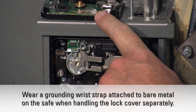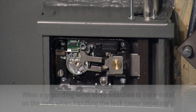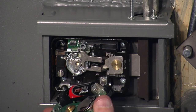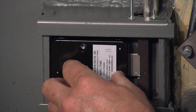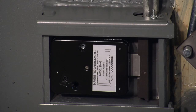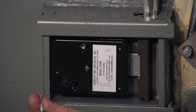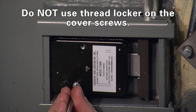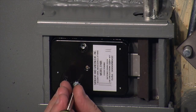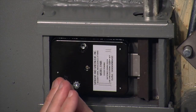Now that we have our batteries installed and we've received good battery check signals, it's time to put the cover on the installed lock body. It goes in so that our pin connector on the cover mates with the receptacle on the body. We have two different length cover screws — the label tells you the longer screw goes in this hole and the shorter screw goes in this hole. Each screw must use a lock washer. We do not put Loctite on either of these screws. We'll install one just barely snug, put the other one in, then go back and tighten each.